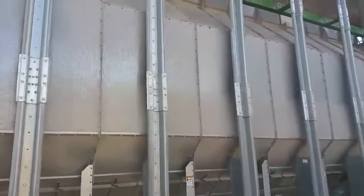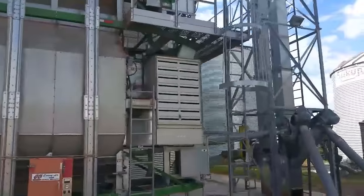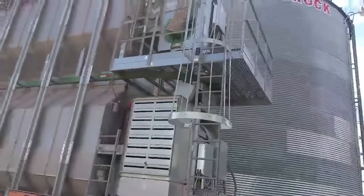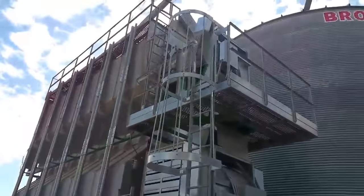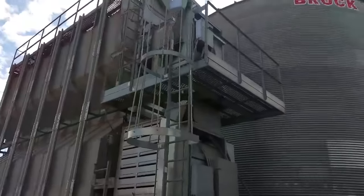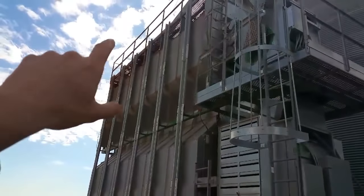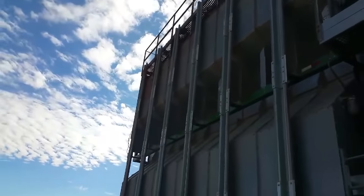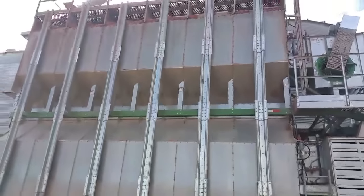How the dryer works is there's two great big fans up front and they pull air from outside. Right now we've got the top one set so that it's pulling air from the outside and it heats that air to about 215 degrees, where we're set right now. So it'll heat that air to 215 degrees and the inside of the dryer in the back is open. Both of these parts of the dryer, the upper and the lower unit, are open in the middle.